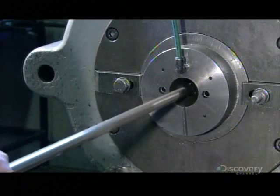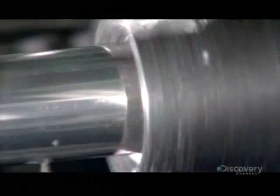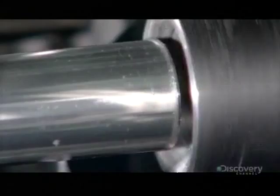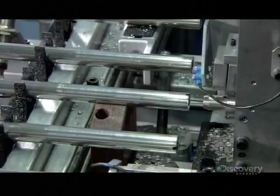An automated cutting tool spirals into the shaft to even the jagged edge. Another cutter spins around the outside of the wider end of the pole to trim it. Next, a machine punches a little hole in that wider end. The hole will serve as a guide during the stenciling of the trade name and artwork onto the exterior.